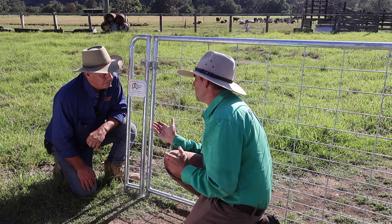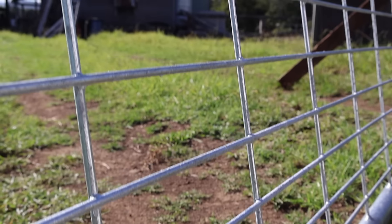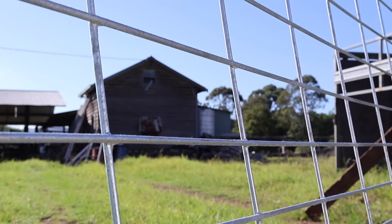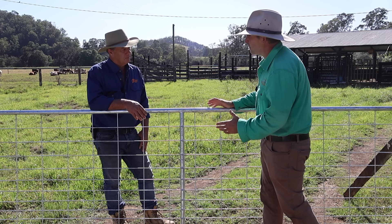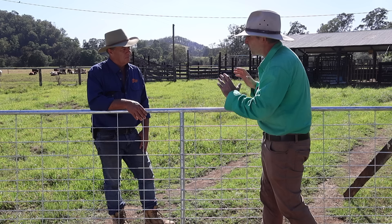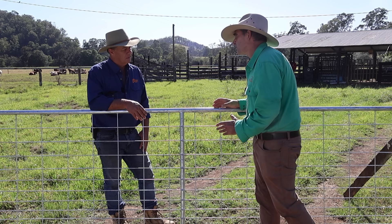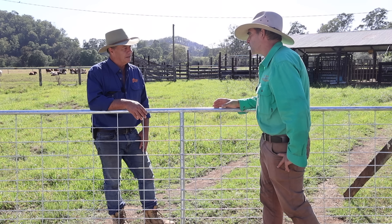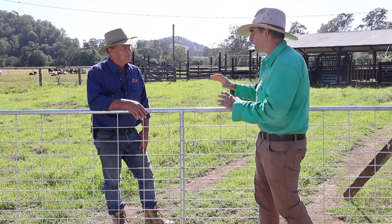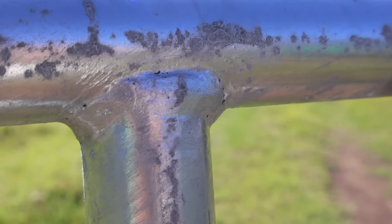You've also decided to use graduated mesh on these gates, meaning they should fit a wide range of animals. Finally, galvanisation - you don't galvanise your frame before you put the mesh on; you actually fabricate the entire gate and then get it galvanised. We've found in the past that anywhere there's been a painted weld is usually the downfall of the gate and ends up being a failure - that's a rust point. So you've overcome that by leaving your hot dip galvanisation to the very end of the production process, which is pretty unique.